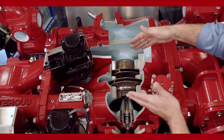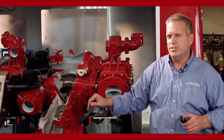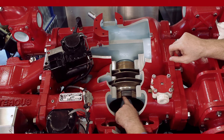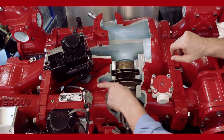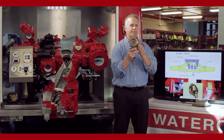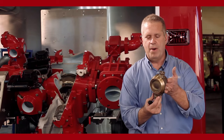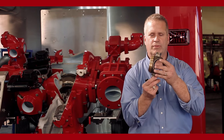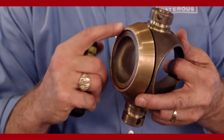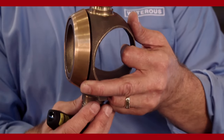Water comes in through the side intake, splits apart, and goes into the first stage impeller — spinning fast enough to produce 100 psi at 500 gallons a minute. That water comes out past the stripping edge, cut down going through what's called the transfer valve. The transfer valve is a ball style transfer valve — a bronze ball. This is a patented design by Waterous; we are the only ones that use this style of valve, patented in 1977. The unique thing about this valve is that the only part of the ball that touches the housing inside the pump is just this surface.